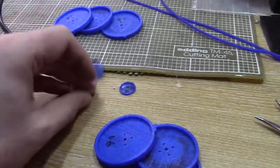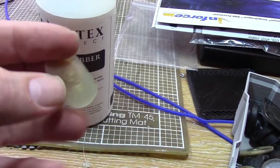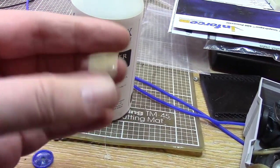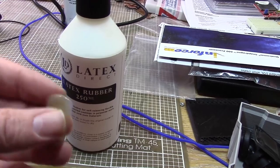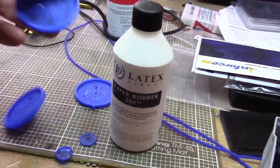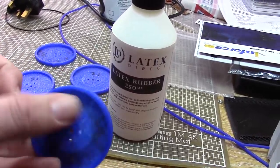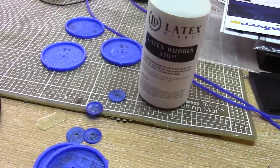I had a thought about alternative ways to deal with this, so I ordered a bottle of latex rubber. I had a brief go last night — I just poured a bit of latex out to see how stretchy and durable it actually is, and I think it's probably a good choice for the material for these little disc valves because it wants to be something fairly soft and flexible. What I'm going to do is 3D print a mould so I can mould some of these little valve discs. And for the diaphragms, I'll take the 1.4mm thick ones, which seemed to work best, and just paint those with a thin layer of latex to seal up all the pores on both sides.